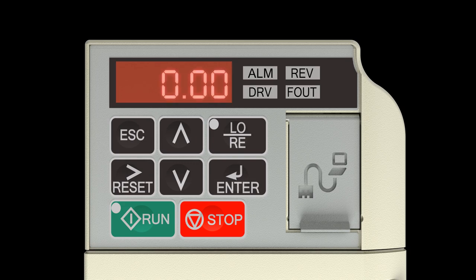Programming: Press the up arrow key 5 times until the display reads PAR. Press the enter key 3 times to confirm the setting to read 0002. If set to 0000 or 0001, press the right reset arrow key 3 times and change the fourth digit to 2 by pressing the up arrow key once or twice. Press the enter key, then press the escape key twice.